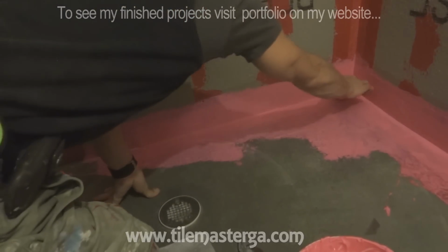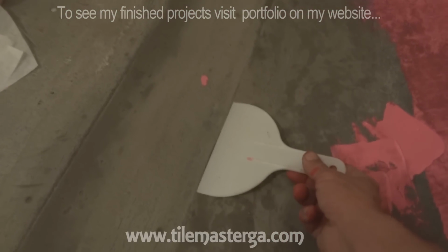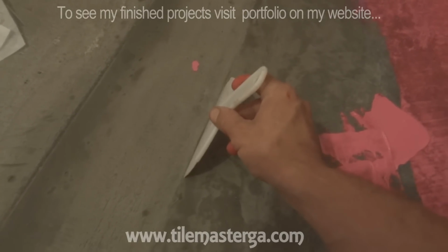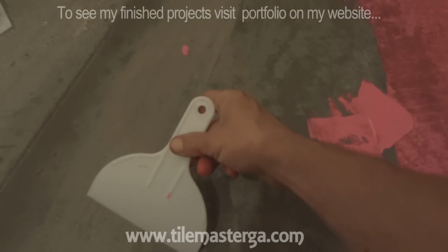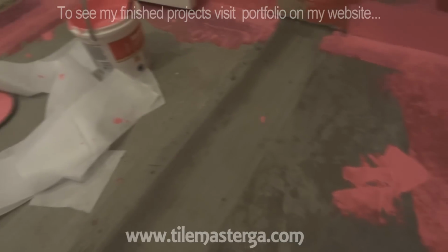So this is how it slowly progresses. Okay, another important part to remember, like I said, I'll be putting this tape on every corner and every joint. Here, where we have the pan meeting with this 1/4-inch board, because our floor starts going lower to the subflooring here, right, at this moment, in this space. We have a transition here, so the goal is to, of course, put the tape through this transition, so if any movement appears, we have the solid surface that will not fracture and will not cause any water to penetrate. This is also fracture membrane.